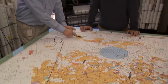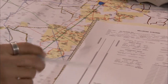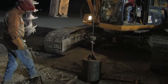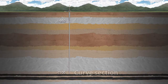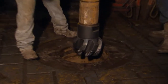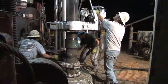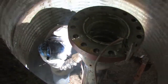The video begins with a brief overview of well planning and site selection. From there, the video provides step-by-step coverage of site preparation, digging the cellar and installing the conductor pipe, rig mobilization and setup, the well plan, spudding the well, drilling the surface hole, and cementing the surface casing.